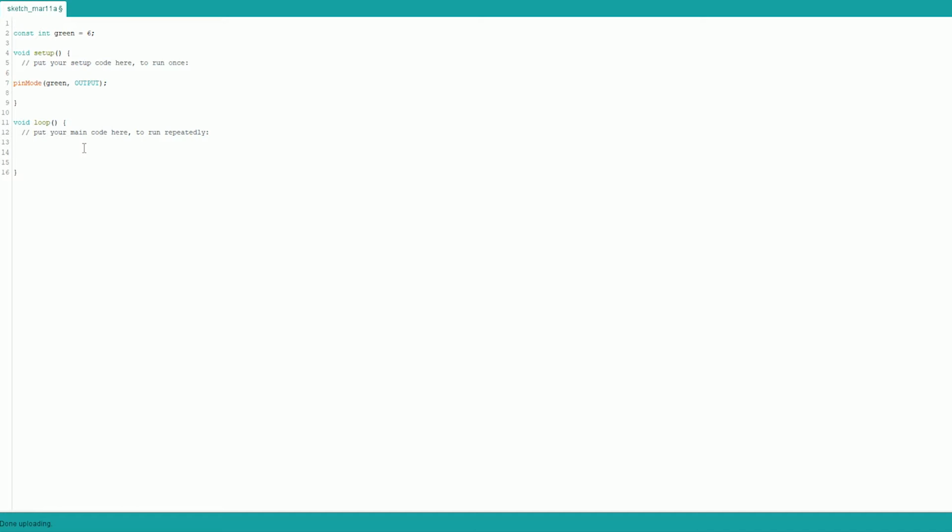We'll start off with digital write green, comma, low. So you could either do low or high, or instead you could do zero. They equate to the same thing, but we're going to keep it low. At least it should equate to the same thing. So we're then going to do a delay of, let's go with 100. So 100 in this case is 100 milliseconds.